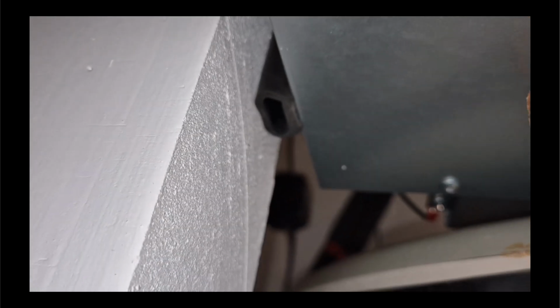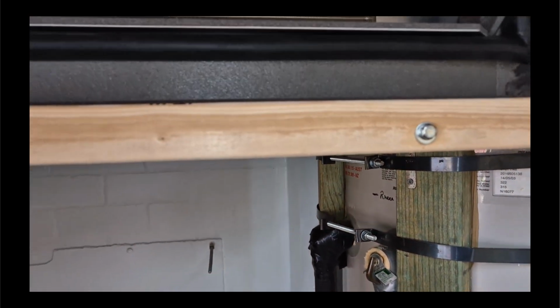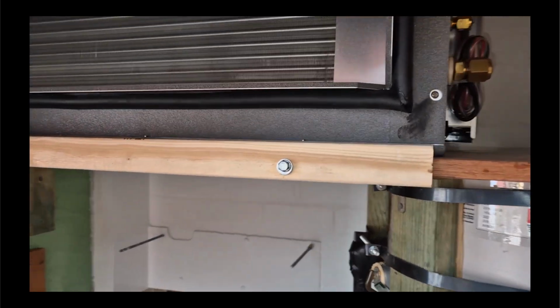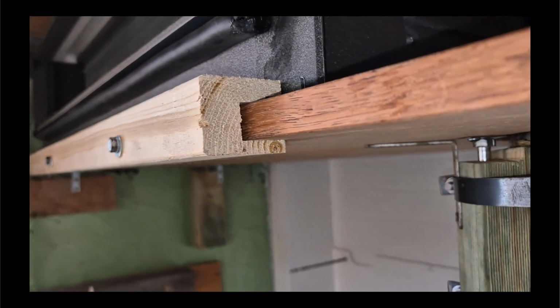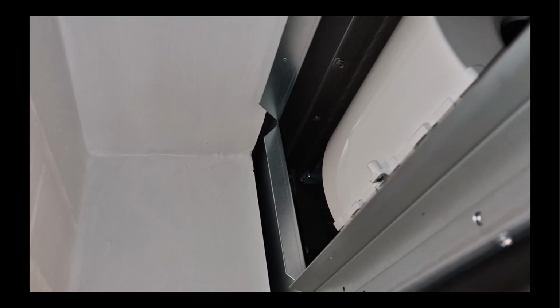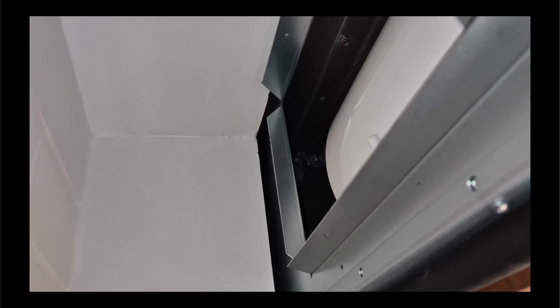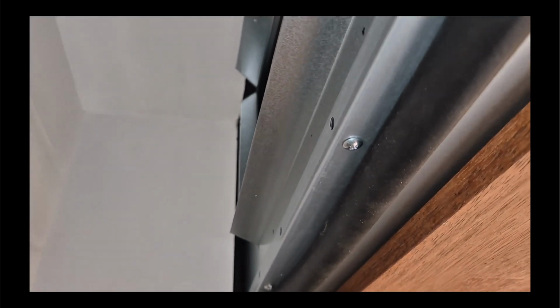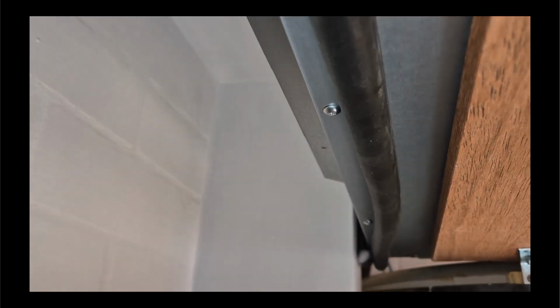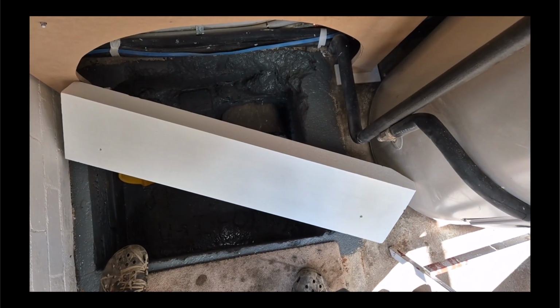And that's the gasket, quite well squashed all around, and that's been held in by a piece of wood which is set up like that to pull in. So you can see the indoor unit is sealed on the sides and top, but not on the bottom. It's actually going to be sealed on the bottom of the unit rather than the front of it, with that gasketing. And there's the last piece of polystyrene ready to fit in there.